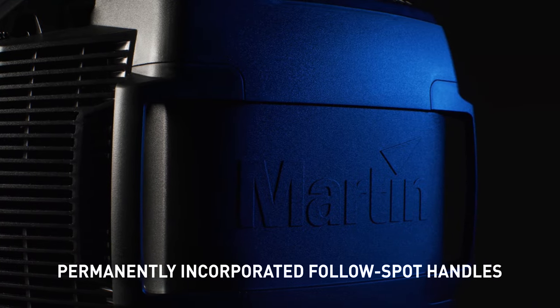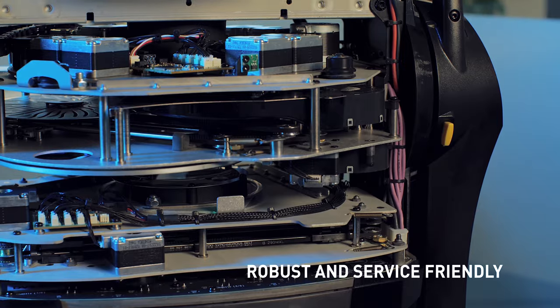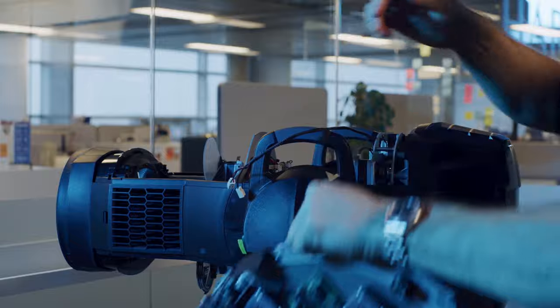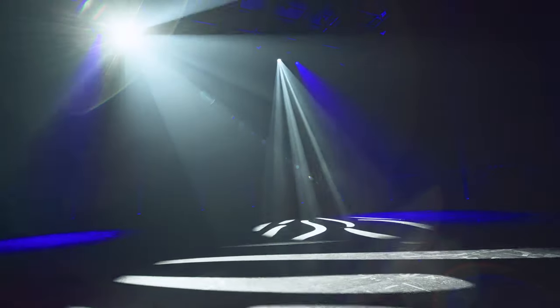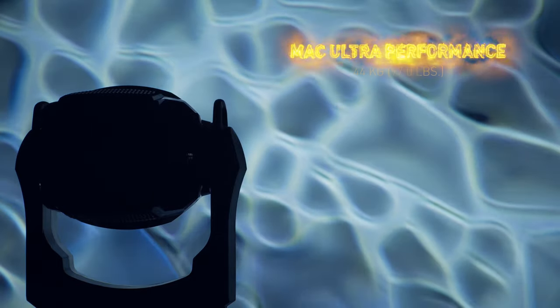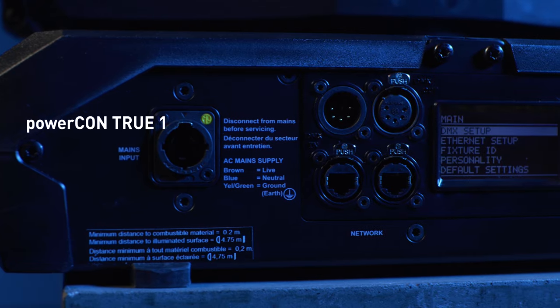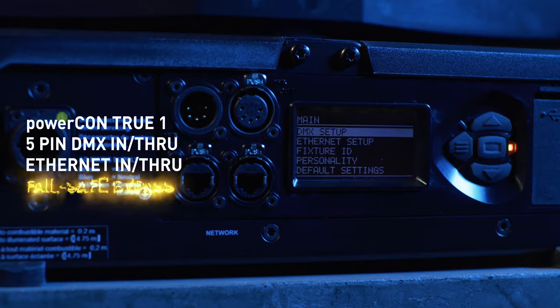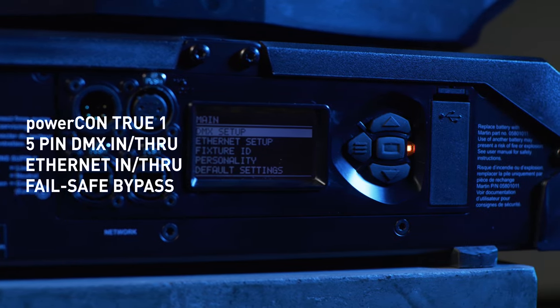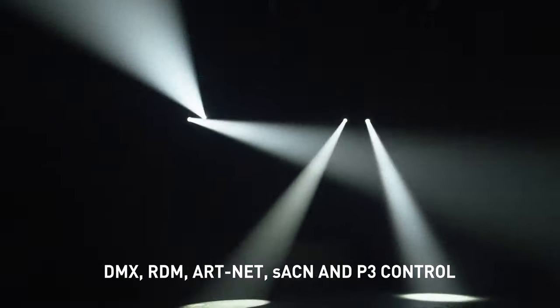Follow spot handles are permanently incorporated and tool-free replacement of air inlet filters is easier than ever to access. Securing ease of service and modularity, and providing best-in-class robustness and reliability, are signature attributes of any Mac moving light. Mac Ultra is no exception, capitalizing on 25 years of Mac moving head development. Despite its rugged construction, the Mac Ultra Performance weighs only 44 kilograms and the Mac Ultra Wash just 39 kilograms. Both fixtures include PowerCon True 1 for mains power, 5-pin DMX in and through, and Ethernet in and through, including a fail-safe bypass to prevent data interruption to the rest of the chain should a fixture accidentally lose power. Control can be managed via standard DMX, RDM, ArtNet, and streaming ACN, as well as Martin's P3 control, and Mac Ultra handles a fully broadcasted network.